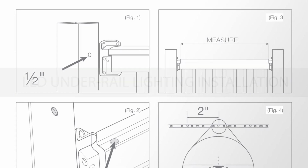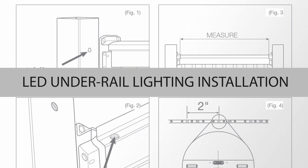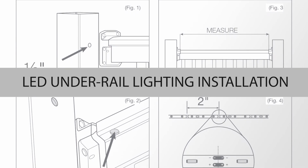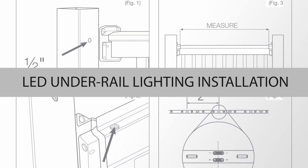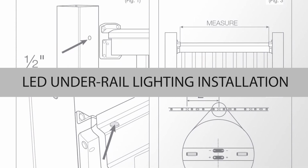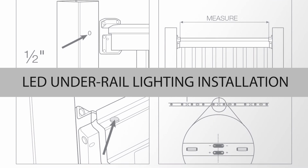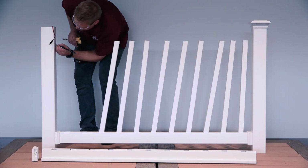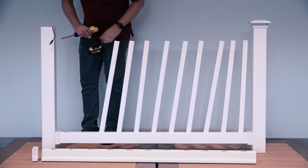Before we demonstrate installing our LED under-rail lighting, first note that you can install your lighting directly onto the underside of your top rail or by using the PVC under-rail light channel sold separately. Also, we recommend installing the lighting before completing your railing install, since you will need to drill through the tops of your posts. Pencil a mark on your posts where the under-rail light strip will connect to the previously installed harness that is running up and out of the top of the post sleeve.